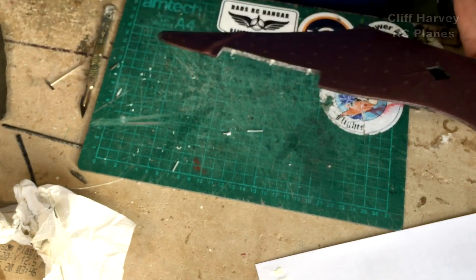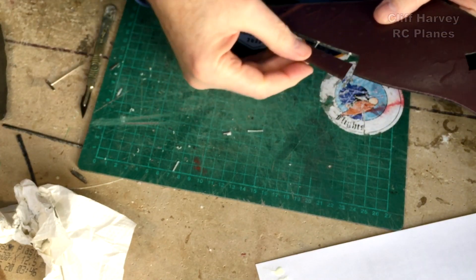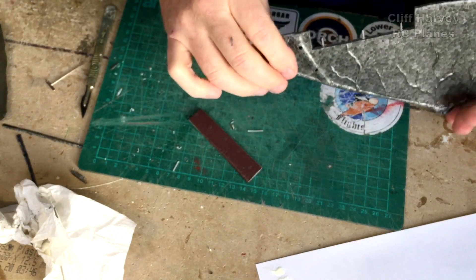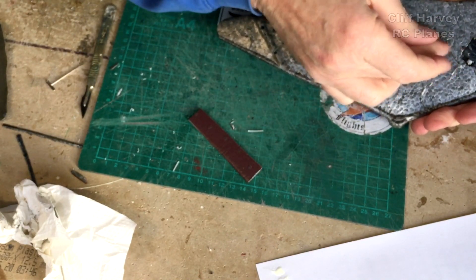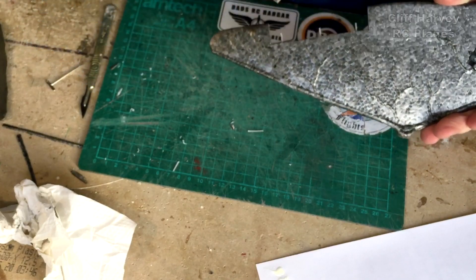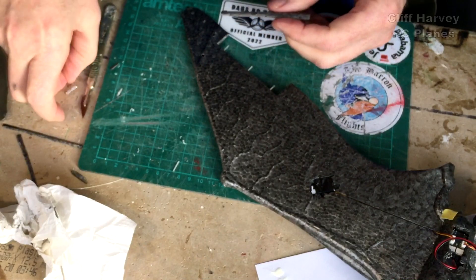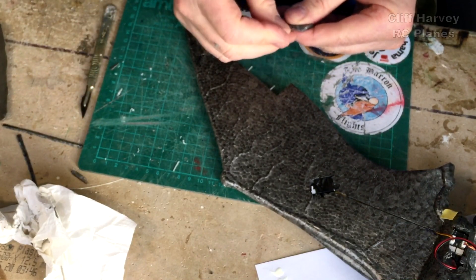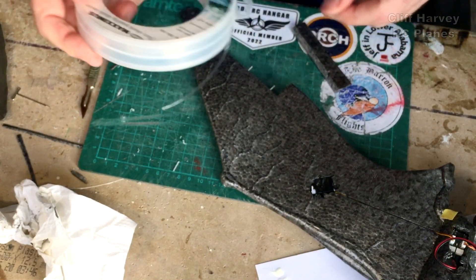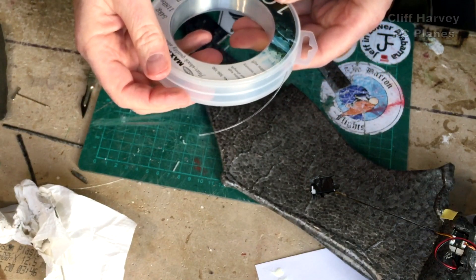Hinging the control surfaces. I've just cut them out — well, precisely. Cut them out on the flat part of the aileron because it curves around there. I'm hoping that this huge angle of the push rod will operate it okay. Cut them out, angled the leading edge and pushed in the hinges using a pin — just crudely pushed it in, lined them up, pushed them in the other side using my favourite hinge material: fishing line.